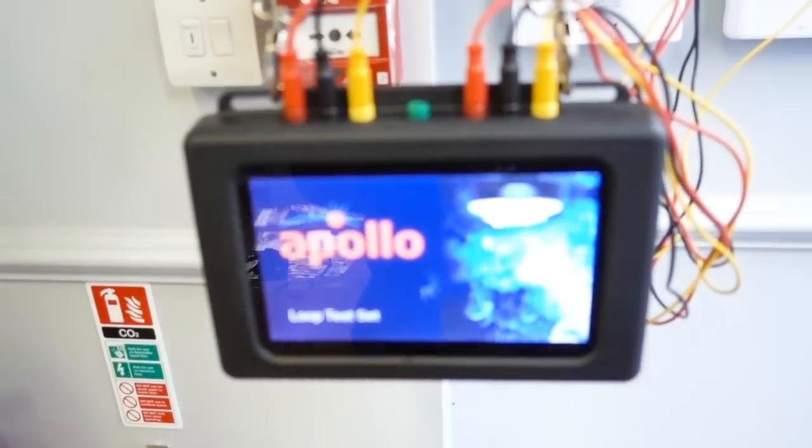Always remember to charge the battery. It takes a little bit of time to load up. Now why would you use a tester? I'm quite excited about this product because quite often we will install a whole system but there's no mains or the panel isn't ready to go in. So you can stick this on the loop to check your circuit and check that everything's doing what it's supposed to — it's fault free. You can check your devices, you can even sound your devices, check that electronically they're working correctly before you power it up. We do a lot of MICC installations, and we've had cables that have been damaged, instances where it's got damp in a certain area, and issues with short circuits. It's nice to know that before final commissioning day — which on large projects is a massive rush and massive pressure — you can do your first fix, your second fix, and use this tester to check before you've got to come back and commission.